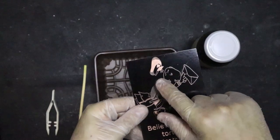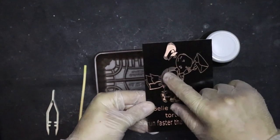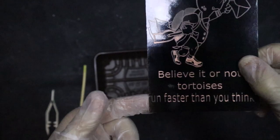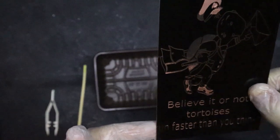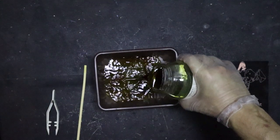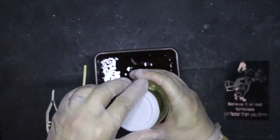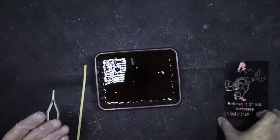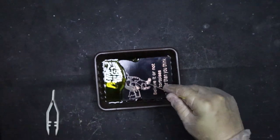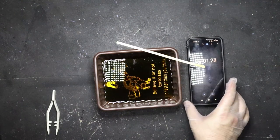I considered cleaning everything up a bit, but there's not really much point — we'll do the best we can, and the areas where the copper hasn't been completely removed may still etch quite nicely. First off, ferric chloride very carefully poured into our container — make sure the container is big enough for your PCB. Now I'm gently going to plonk it in. I'm going to put a timer on and come back in maybe two or three minutes to check on it.